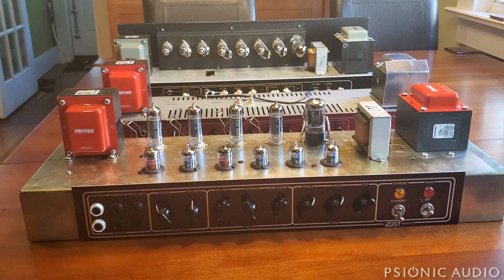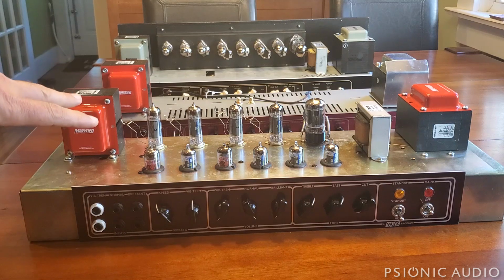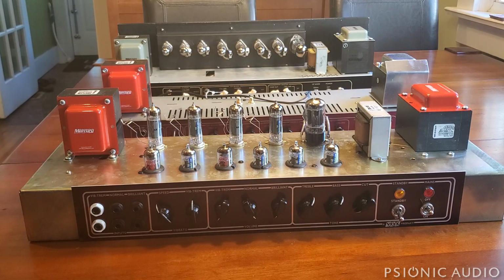It's got really cheap transformers for the price point, really cheap pots for the price point, and it's also overfiltered. And the Custom Classic as well. It's too bright, not enough compression, reverb tank's terrible. But all four of those amps, the Custom Classic's not represented here, just because I don't have one for this purpose right now, all four of those can be made to sound like a real AC30.